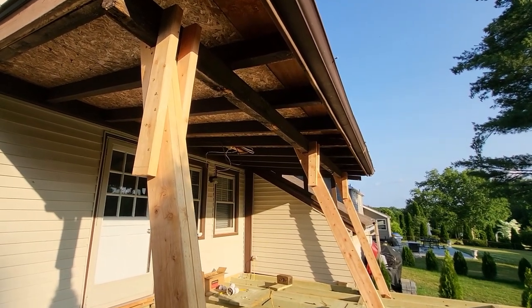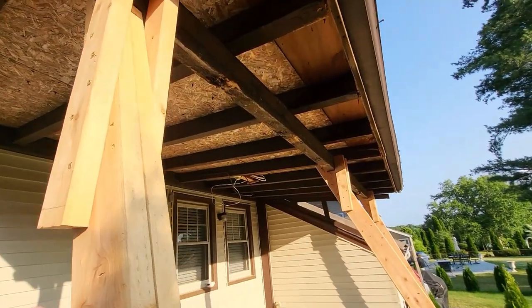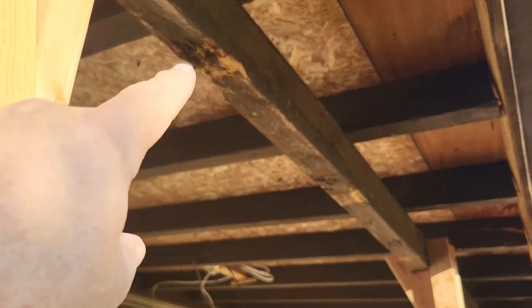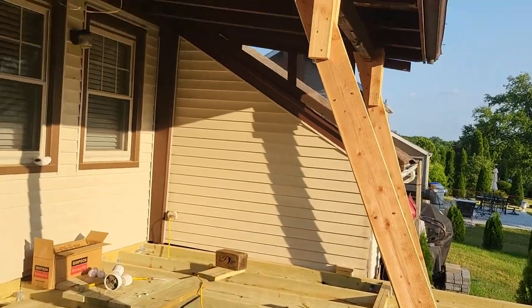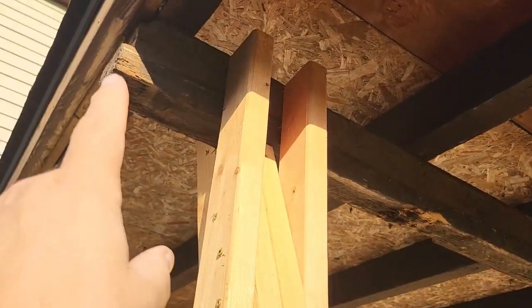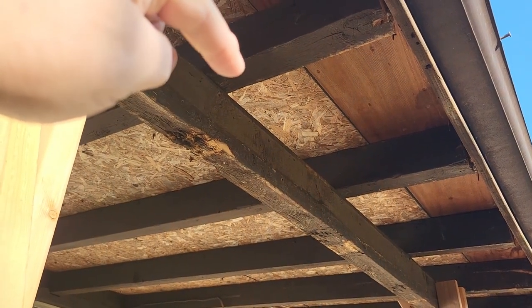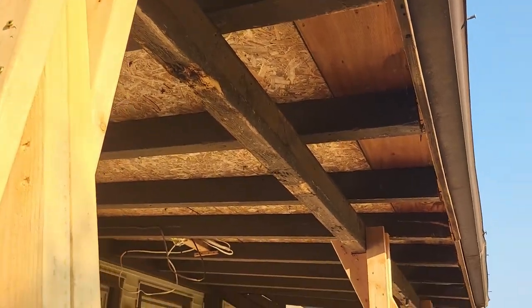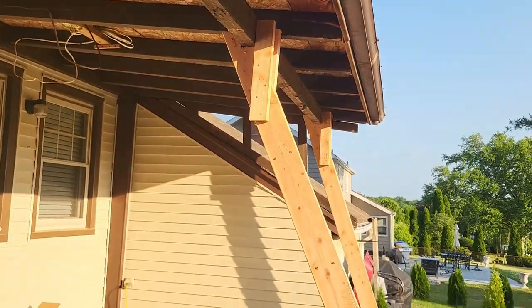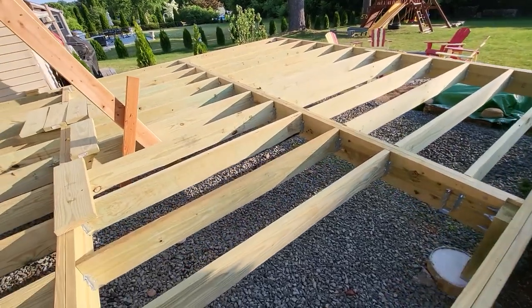I will have to cut that out, but I want to do it surgically because, as you can see looking at the board now, when we ripped out the old 2x4s that created this enclosure, it made it an enclosed porch, the wood is so rotten, it just ripped it apart. And so I don't want to do any damage to the roof joist. So if I can get in between the supporting joist and the roof joist and just cut the nails off, that'll reduce any damage to the existing joists. So we're gonna set this up in time lapse and we're gonna record it. So I'll just let you get a peek at what I've done so far.